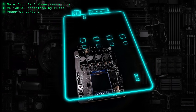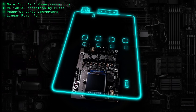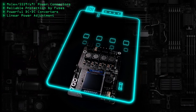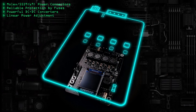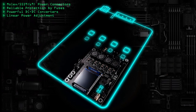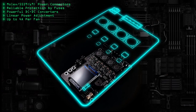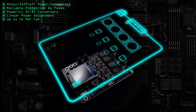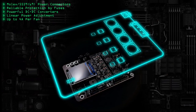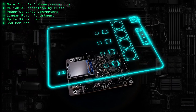These are quite powerful synchronous chips with per-channel high-side MOSFETs, controlled by digipots. I have videos on my channel about both step-down converters and digipots — I'll leave links in the description. These converters can output up to 4A, so I've provided powerful inductors. With that said, 4A is at low voltages, so the inductors have a good safety margin.